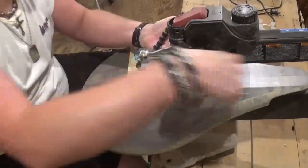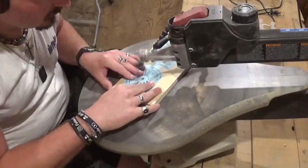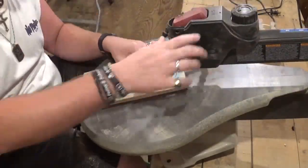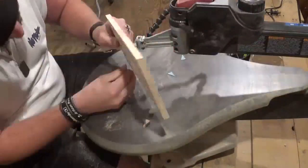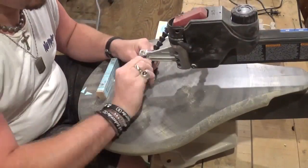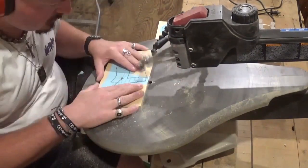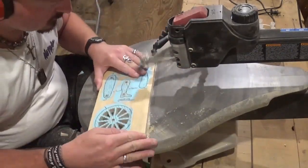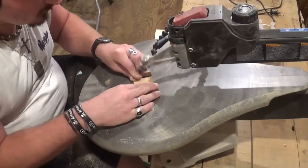Over here on the Scroll Saw, we're going to begin by cutting all the parts out. I am using number five reverse tooth sharp tooth Scroll Saw blades for all of the cutting on this project. Again, I'm stack cutting the pieces you see here because I need two legs, two arms, two of the thighs that move, and I don't need two of the wheel — I'll just put one aside for another project. Cutting out the handlebar here, and this is kind of like a compound cut — has a nice little 3D effect. Now I'm cutting out the guy. The arms need spacers, and this is half inch Baltic birch plywood.